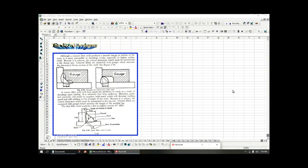One of the ways that you want to do a weld inspection is by using what they call a weld gauge. The weld gauge can identify welds that are concave or convex. If you have a concave weld, you're going to have a feeler gauge that is going to measure the depth of the cave of the weld. It's going to tell you if the weld was done perpendicular and to what width your weld is. So you have different gauges for concave. Similarly, if you have a convex weld, you're going to have a gauge that measures the height of the convex portion of the weld, which bulges out. So you have basically excess metal deposition, and it's a bit wasteful on the metal.